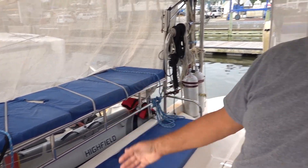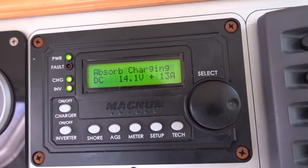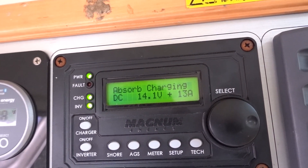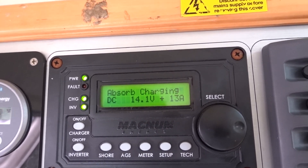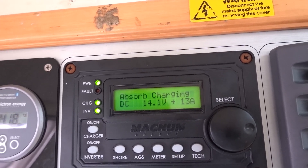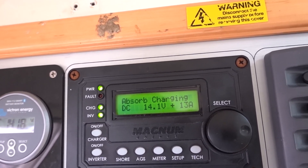We've seen some panels we like. We have to do some installation stuff we don't like — we don't want to lose our sunbed — but if it means having enough power to live on and to be energy independent, well then that's what we've got to do. So that's the plan right now while we're in the marina. There's our current battery state of charge at absorbing at 14.1 volts and 13 amps. We want to see that go to an equalization charge of 14.4 and half an amp, so we're going to keep trying to drive that up today.